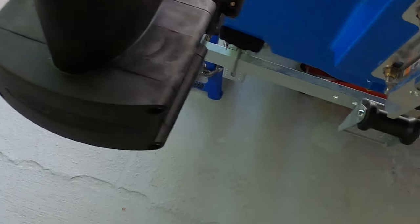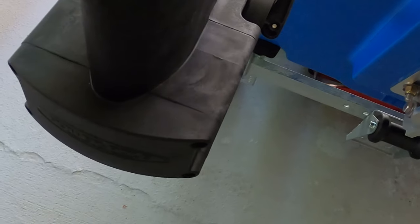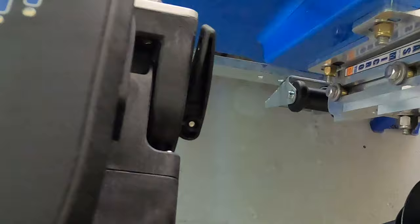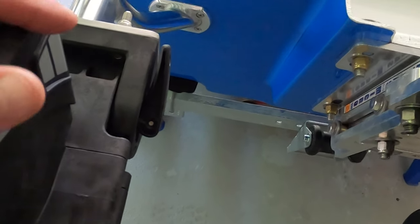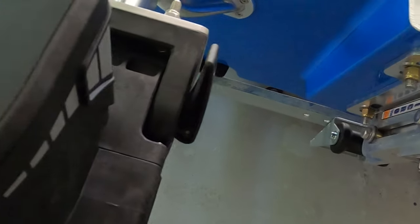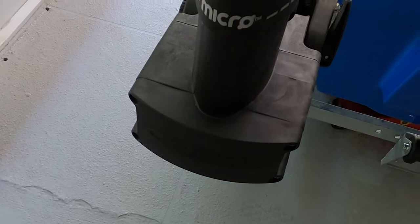The only thing I'm not going to do today is hook up the wires — I'll put the wires on but not connect them, just because at this point it really is a wiring thing. Some people may take it somewhere to have it wired. They sell the battery that goes on here, but I'm just going to run the harness directly to my Odyssey gel AGM battery. This boat only has the jack plate, starting engine with an alternator, a bilge pump, and lights — no live well or anything. This is for backcountry sight fishing, artificials only. Let me go ahead and put the stick in.